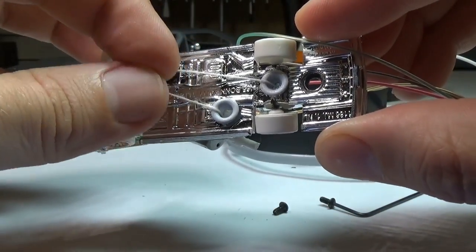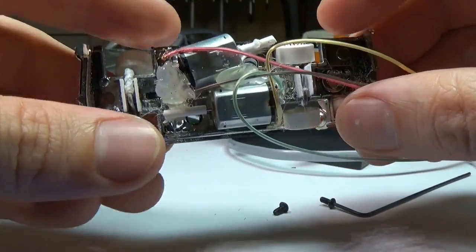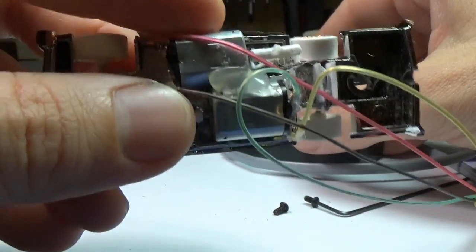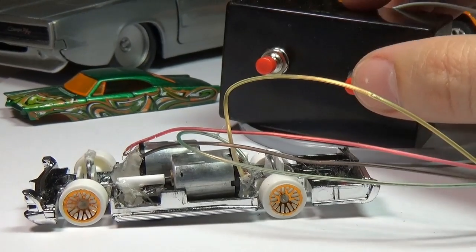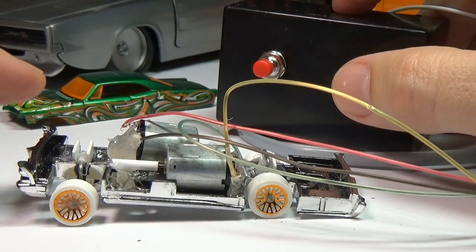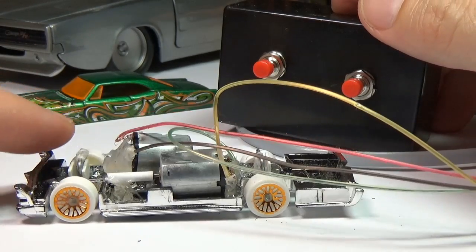You can see that the string comes out the axle hole, across the base, and then up into another eyelet, and then is glued to a tube of styrene that itself is glued to a shaft of a motor. I'll put a link below for the eBay auction for these motors. Be sure to leave enough slack in the string so that the axle can move all the way to the top of the grooves you made. The motors are glued into place so that the styrene shaft is positioned over the hole and eyelet.